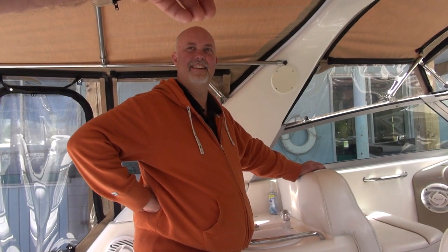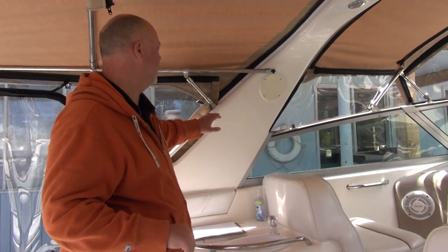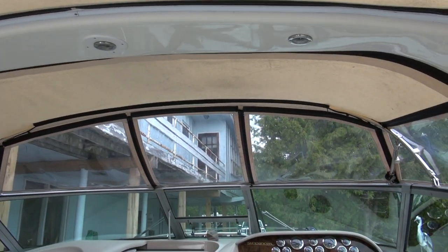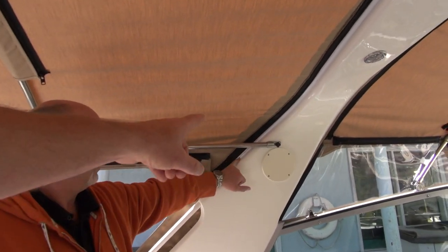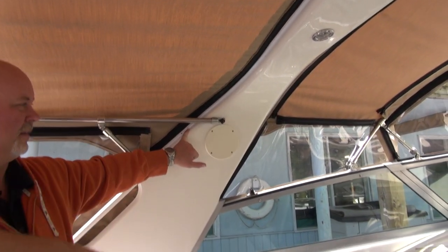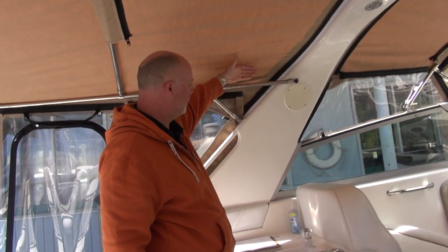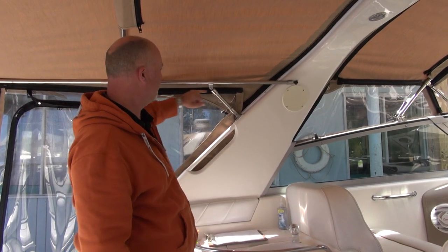So you were just going to point out a couple of the neat little features that you are now incorporating in a lot of your tops. When you came in, you had a full zipper across the top but then you had this 8 or 10 inch piece on both sides which caused a leak — where the two pieces came together it was getting in behind and dripping. So what we've done is carried your roof down a little bit, tapered it up, and that enabled us to carry your zipper back.